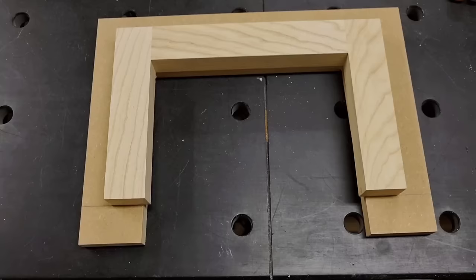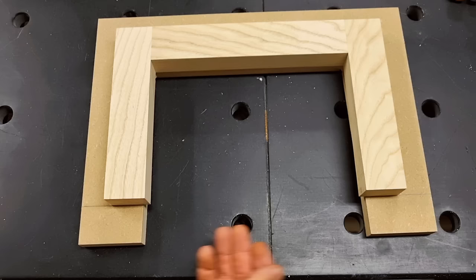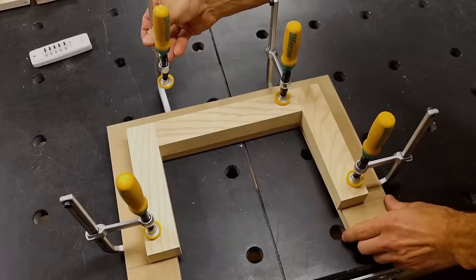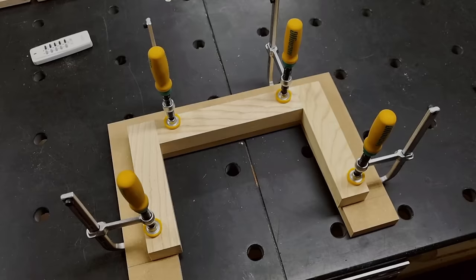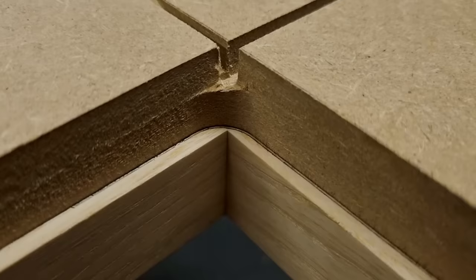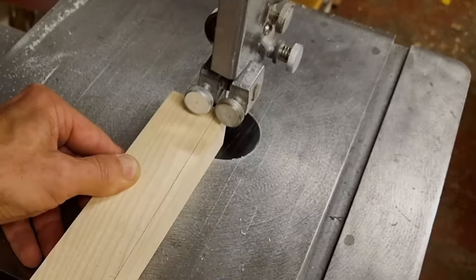The template is completed; now it's a matter of shaping the workpiece after the template. I place the workpiece on the back side of the template — that has a slight advantage I'll show in the next step. I place it on the baselines and for one-offs this is good enough, though for many pieces I'd add hard stops. I make sure to have about the same protrusion left and right so it's symmetric, then clamp the workpiece to the template, flip the package over, and transfer the contour from the template to the workpiece. Using the back side of the template gives an unbroken radius that I can easily transfer.